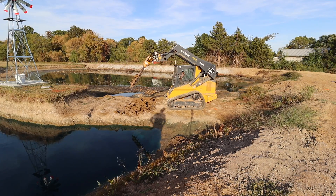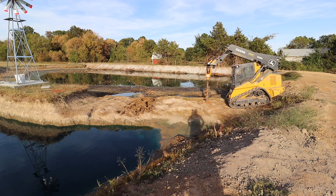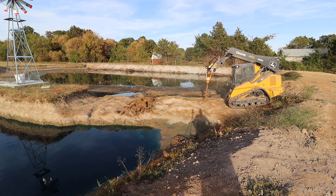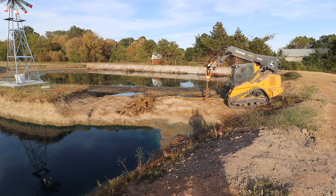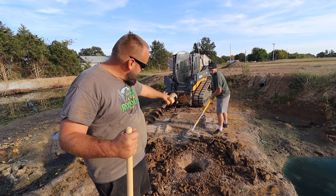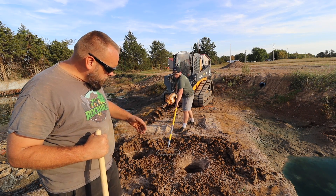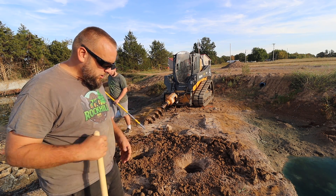The first two holes went pretty smooth, and then I had to back up for the second set of holes — that's where I ran into a problem. The skid loader was sitting on a little bit of an incline and it was hard to keep it from creeping forward, and the angle of everything just didn't want to drill a straight hole. So I need to turn around and face the other way, but first I'm going to pull all this loose dirt away and run the auger through again to pull more loose dirt out, because the hole broke up four foot deep but two foot of that is now loose dirt — really we just have a two foot deep hole practically.